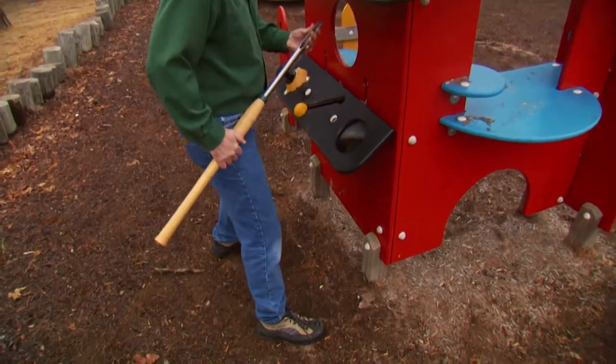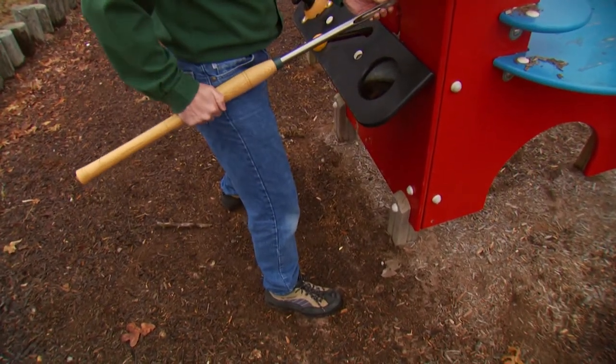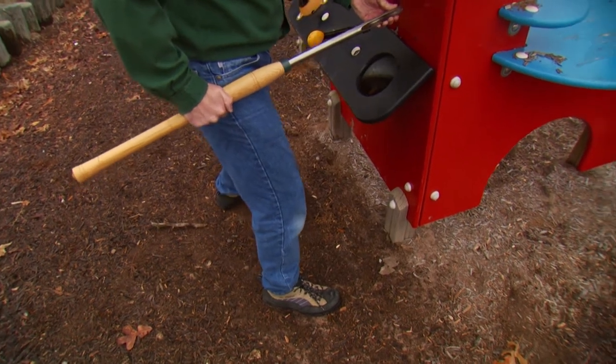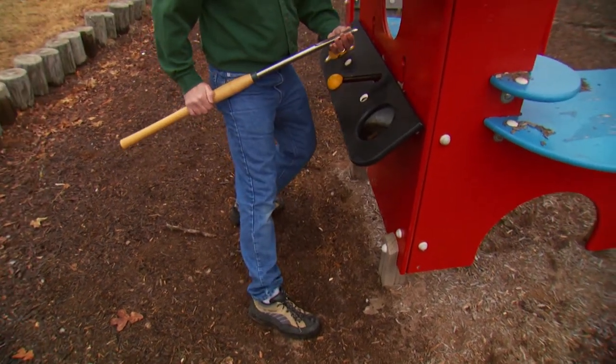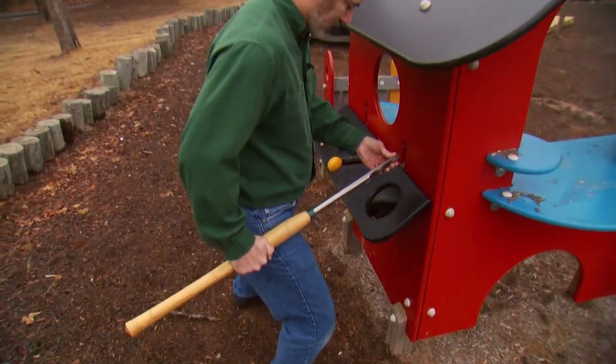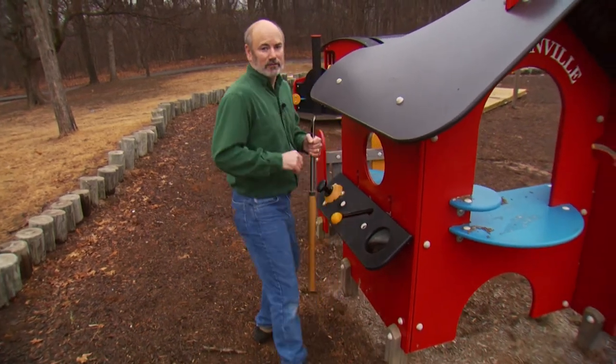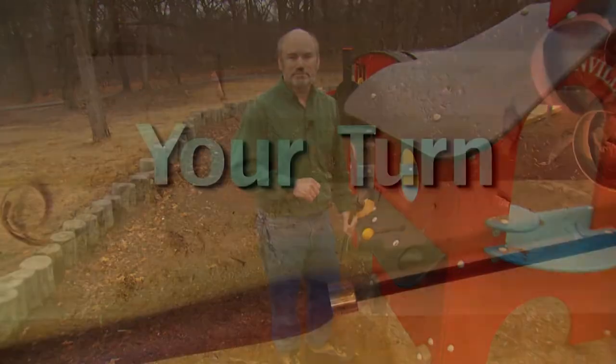So I put my foot and my leg and my body where I want to wind up. So then the tool is into my hip. This is where I want to be. Then I coil my body back. I start my cut and I just naturally go into that position. That way you're balanced and your cuts are easy to control. That's why balance is so important to woodturning.